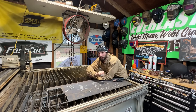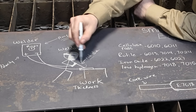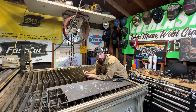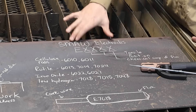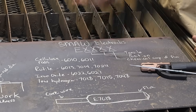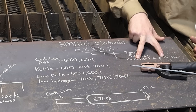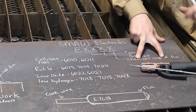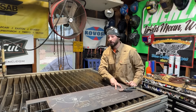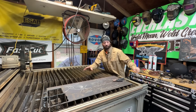If you've got a really thick piece of work, or even if it's super cold outside, a cold piece of work could make it a little bit harder to get going. All of this kind of focuses on that welding electrode. As far as SMAW electrodes go, they have numbers and classifications - we should know weld position, chemical composition, and the makeup of the flux on that welding rod, which will also tell you what polarity to run. You don't have to guess. There is information already on everything that will tell you.